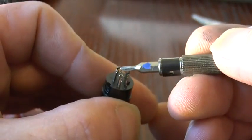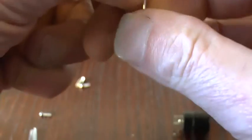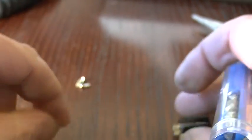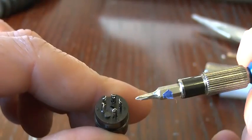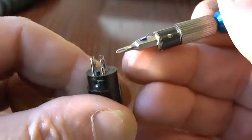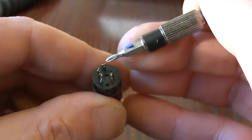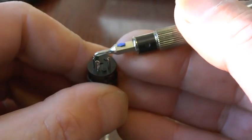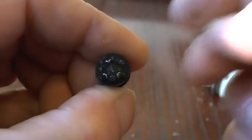As we saw on the earlier diagram, you need pin 1 for the audio. We're not going to use pin 2, so we'll get rid of that one. We need pin 3 for transmit. We don't need pin 4 because that's for the up and down buttons, so I'm just going to push that one through. So there you go — much, much simpler.